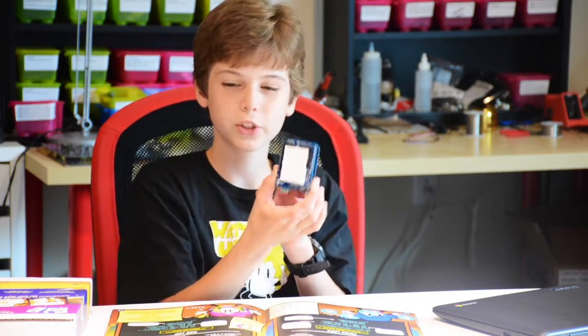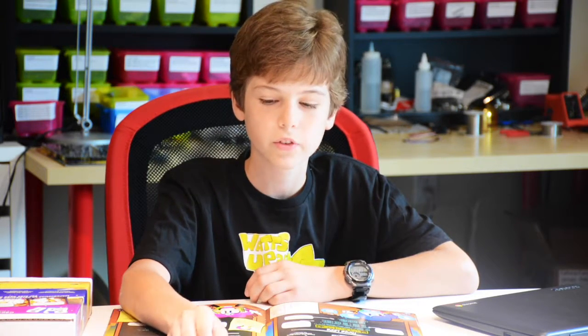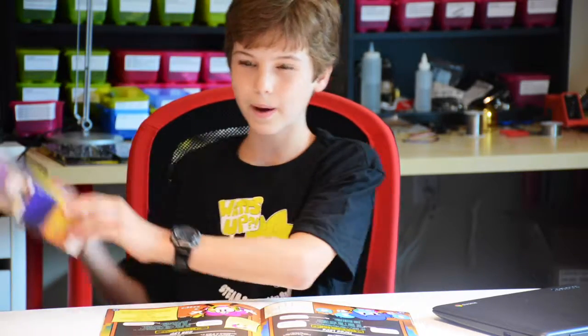You need an Arduino board and an Arduino prototype shield. You need three resistors — 220 or 330 will work perfect — and three LEDs and three black wires. If you don't have any of those things, that's perfectly fine. You can go to our website podpie.com and buy a kit. It has everything you need. You also need a computer.